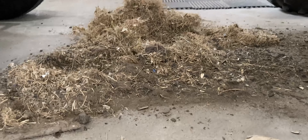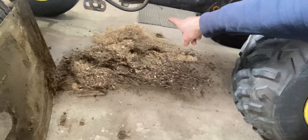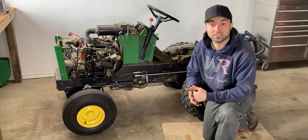Did you guys see how much debris was underneath that mesh screen in between the frame rails of the John Deere 332? There was also probably a mouse nest right there, and that's another reason why there was so much grass collected between the frame rails. Make sure you do the same thing at home, especially before the cutting season — remove all the old grime so your engine and rear differential can cool properly. That's another reason why oil temperatures can run a little higher during summertime. I blew out everything between the frame rails and now I can see most of the mechanical components.